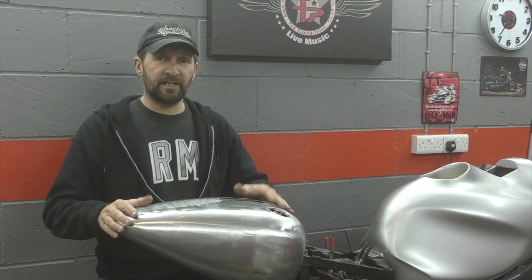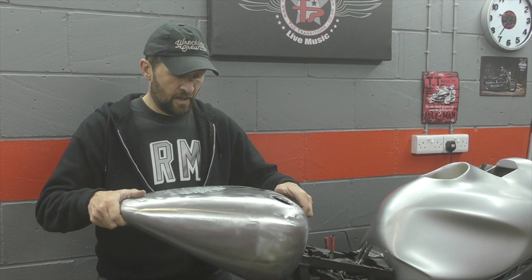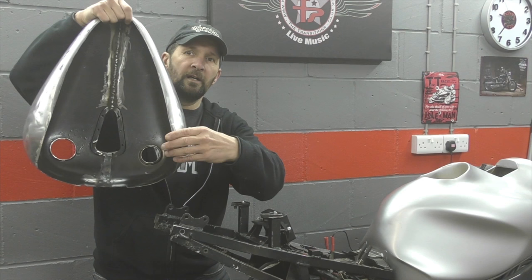Since Wednesday, I've looked at this again, and of course, I watched in the editing, which told me a lot about something that I wasn't aware of. And I bent these frame rails in. I moved them in by about, actually, probably nearly an inch and a half each side, so they're kind of 3 inches closer together. And I was still a little bit foxed at the end of the video why these sections here were still fouling when they hadn't done before.